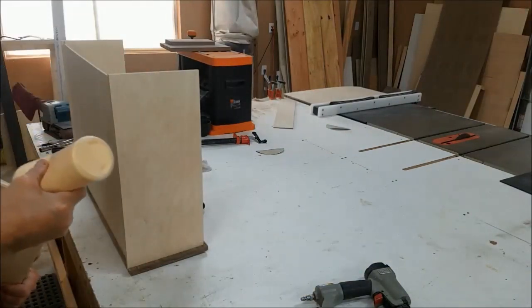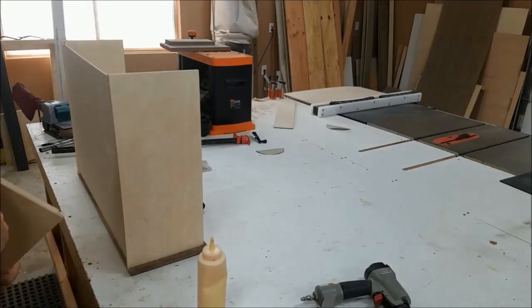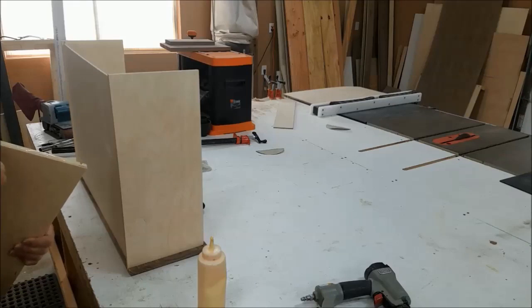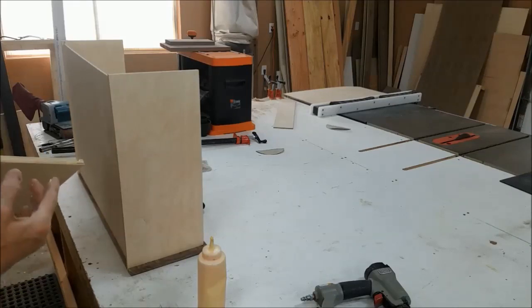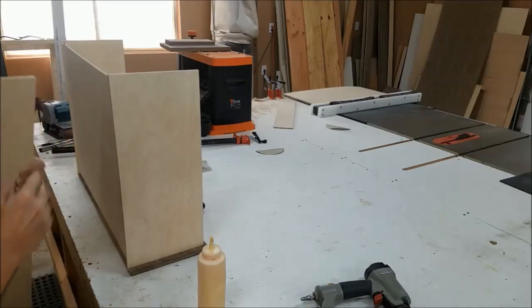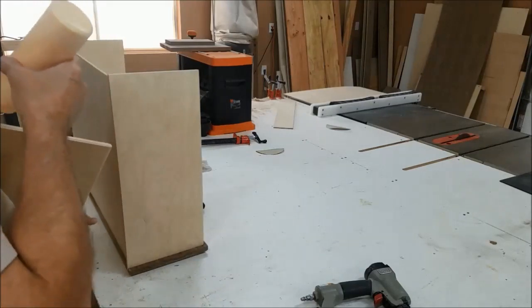What I do is I make the drawer back a 1/4 of an inch difference in height than I do the sides. What that does is it has the drawer back stop just before the radius on the top of the drawer side. So that gives me a nice clean look too. And you'll see that on this drawer if you didn't catch it on the assembly of some of the others I did.